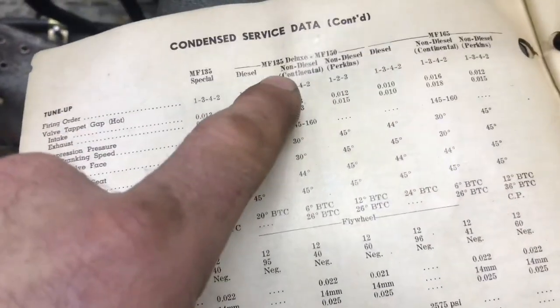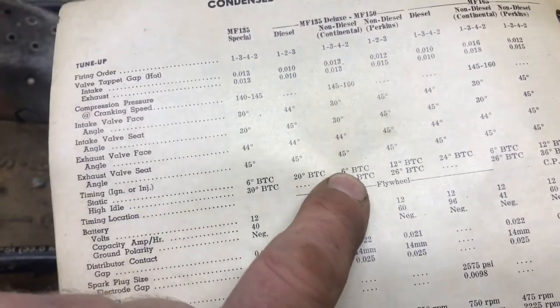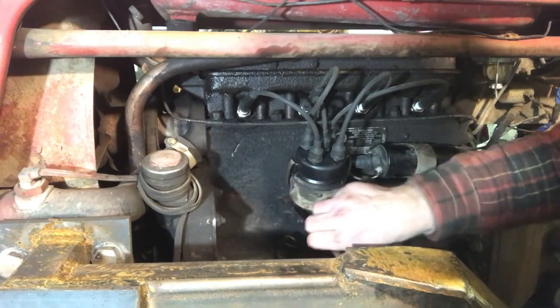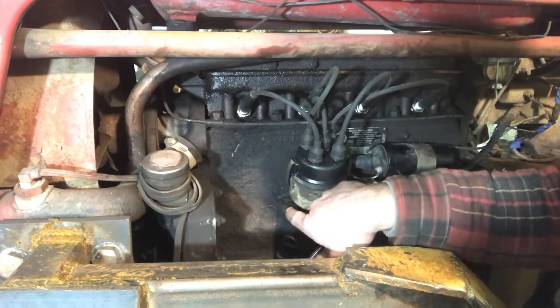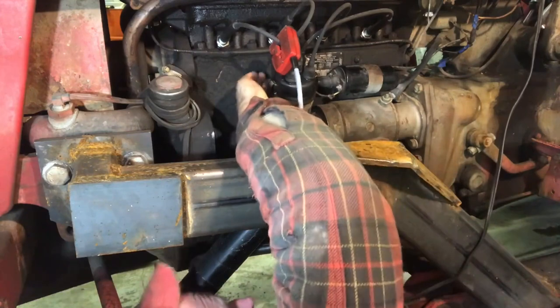We're back to the book looking for a non-diesel Continental, looking for timing static, and it says six degrees before top dead center. It is clearly not six degrees before top dead center — it's probably about three degrees. We're going to loosen off the distributor and adjust it to get it to six. Loosen this screw off and see if we have enough adjustment on this one. If not, you loosen the other one and it moves the whole bracket. I have the timing light set at zero degrees. You run the tractor at idle, check the timing, then reach up and turn the distributor until the timing is reached. We got it to six degrees before top dead center.